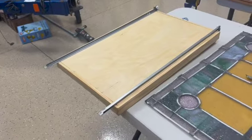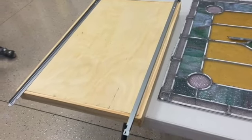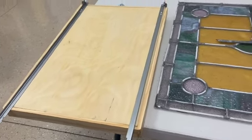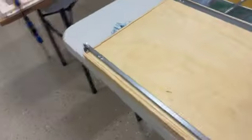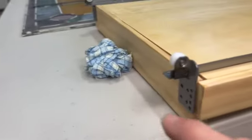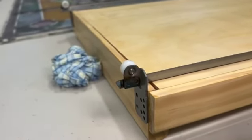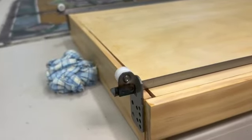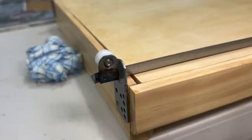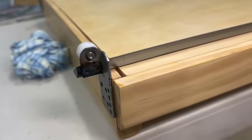The other critical dimension is going to be cutting the drawer guides that go on the drawer itself. We'll lay it on there, mark it up from front to back. The other thing I'm going to do is clean up the back a little bit — right here we have a little extra piece of metal. This thing barely fits, so I'm going to actually grind that extra bit of metal away just to make sure we have a little more margin of error. We'll get that to the bandsaw and cut it up and then the grinder work will be done.